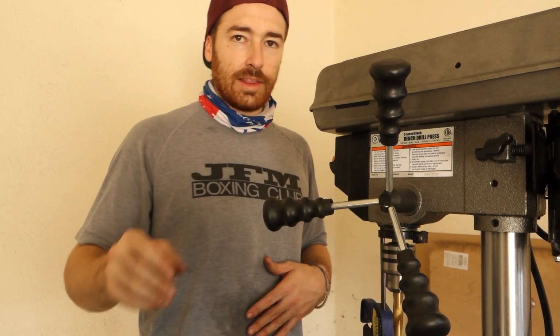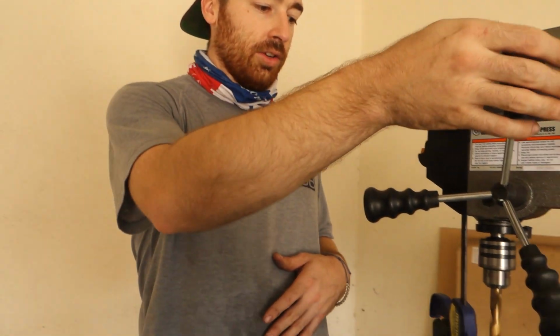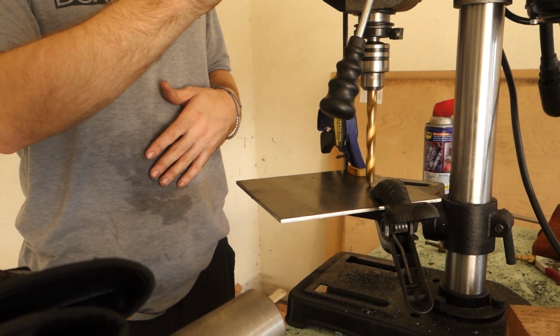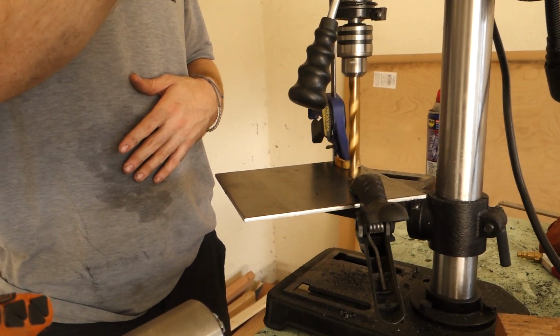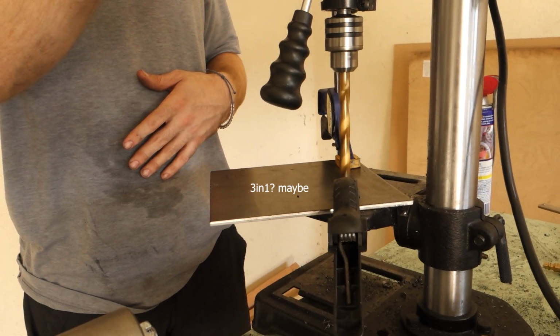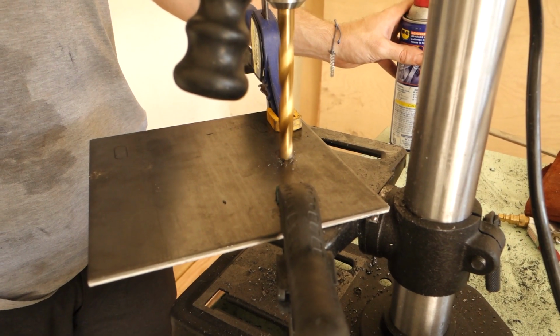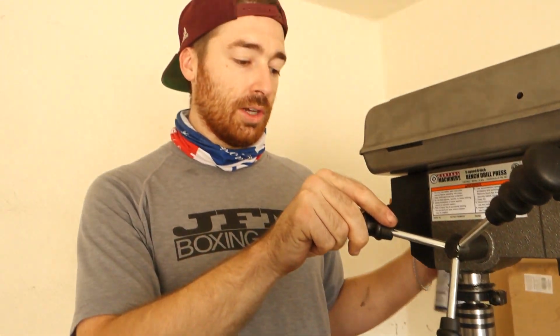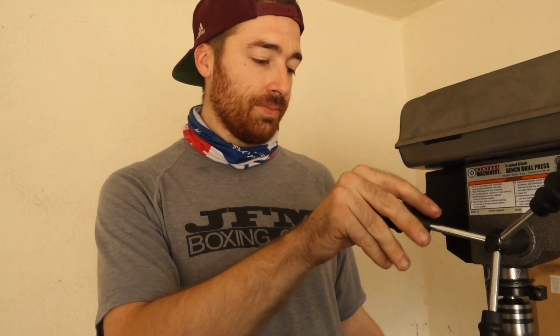Turn this guy on like that. Okay. And you'll start to feed this down. Alright, now I don't have, they make special oil for drill presses. At some point, it starts to get hot. So I've just been using WD-40 because we don't have any other oil. And you just want to drill it all the way through in all those holes, and then you're going to take one of those plates and mimic it.